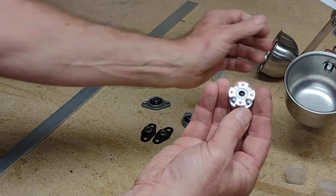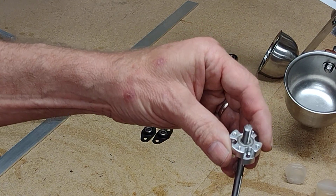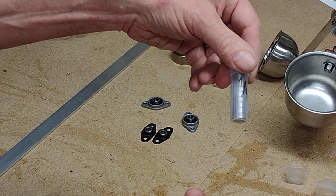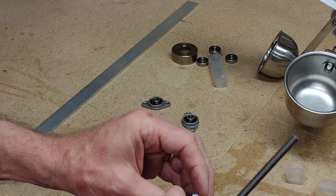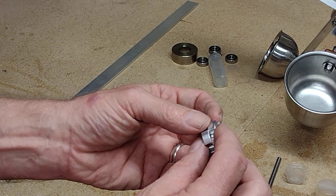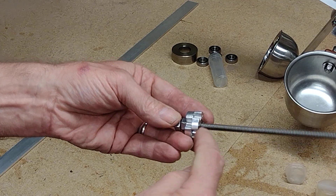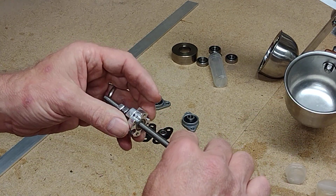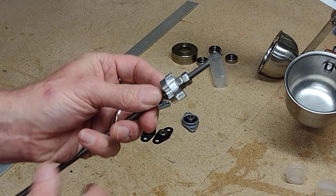This is a little housing from a robotics firm — I'll have it linked below. It has a quarter-inch ID and the bearings are half-inch OD, which are readily available. There are two bearings inside, and there's a little flange around it with holes so you can attach things to it — which you saw on the whirligig a few minutes ago. These can be a bit tricky: if you squeeze too tight with a nut it can bind the bearing so it won't spin, but if it's too loose it spins on the all-thread, which you don't want.